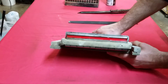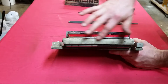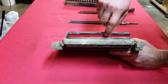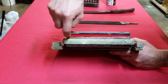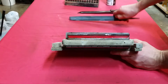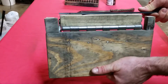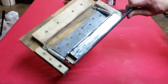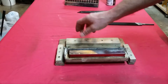On the front to hold the knife, I don't like messing with clamps especially when I'm trying to grind something on the belt sander. So what I did is I've got a tool holding magnet right here. It's two stainless steel bars and on the inside there's a magnet here, here, and here underneath this tape. Three magnets, about two inches long, and that thing will hold quite well. It holds its own weight and then some. It really is a good jig.